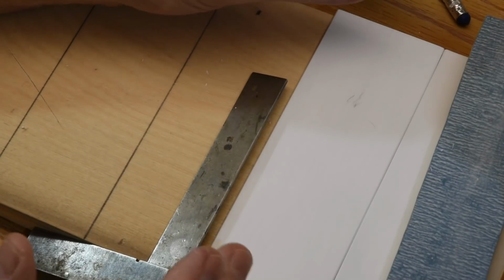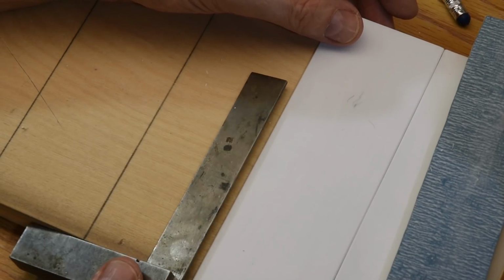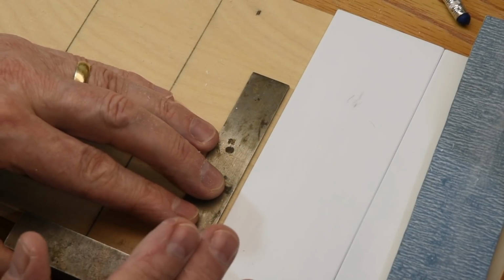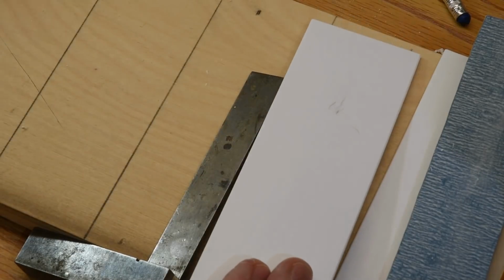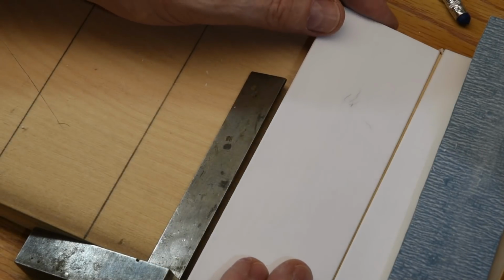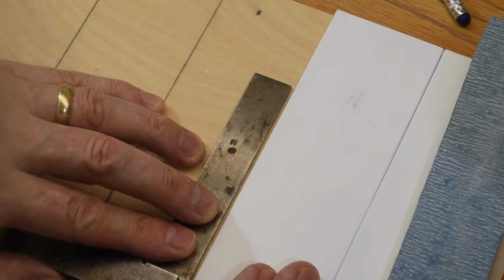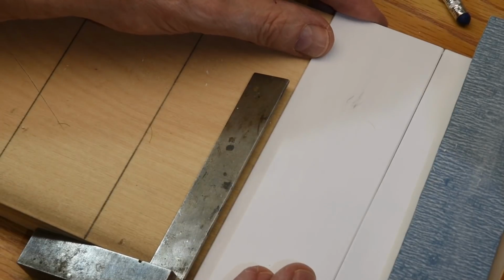Okay, so we're about 2/3 of the way down now with the panels on the brewery flat here. I want to show you another condition of runout, or how to deal with it. Here I have this panel I pulled off my stack. I'm working from a stack that's pre-cut. Now, when I lay this in, I'm just going to check it now because I don't want to let it get away from me. When I put this square here, sometimes the panels might not be totally square on the edge. See how I'm moving it there?